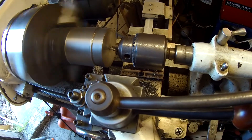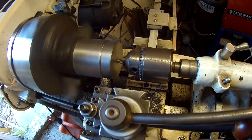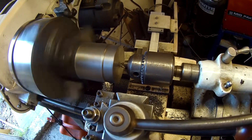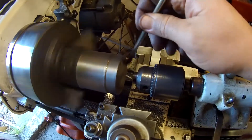I've started to turn the outside diameter, but I was getting some chatter — I have too much stick out here. To be on the safe side, since I have a lot of material to remove, I'm going to center drill the end of the bar to run the live center.